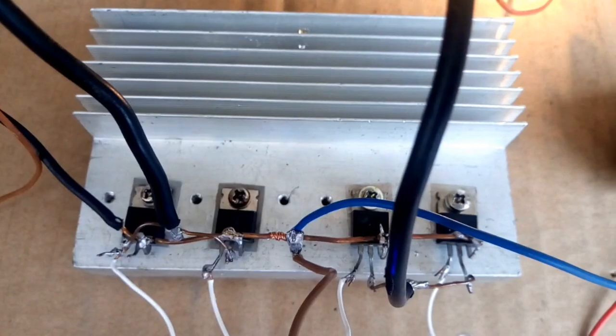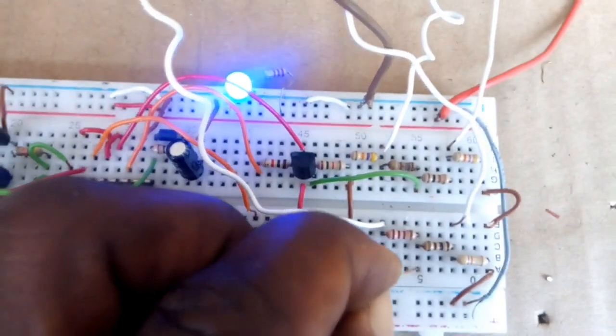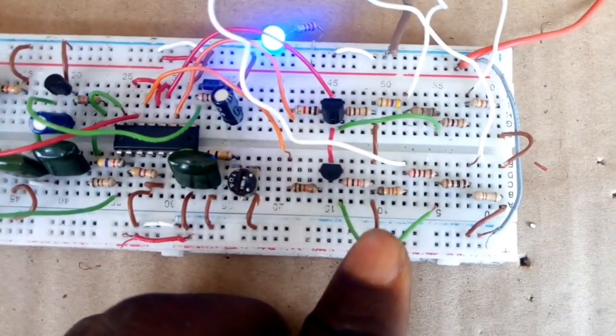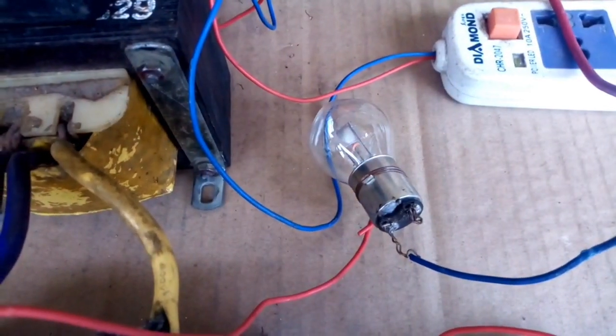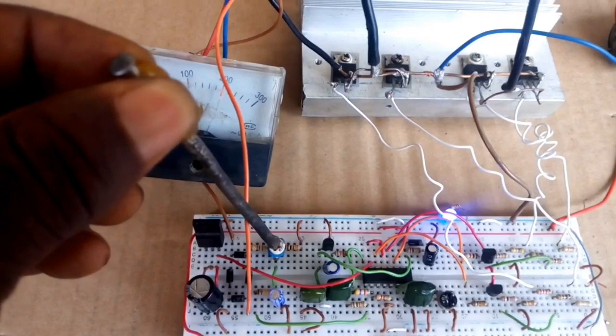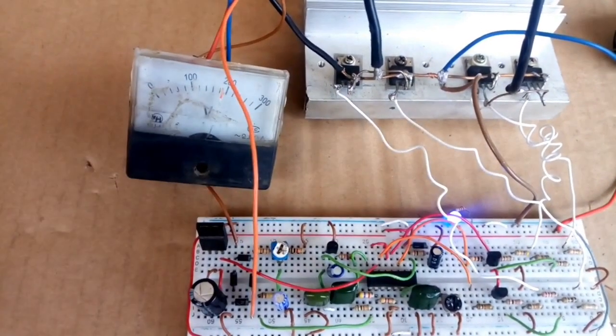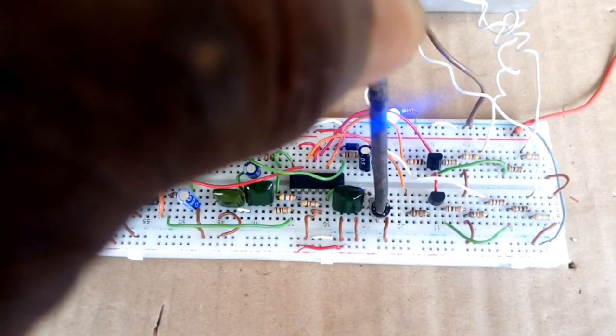Do not connect the wire from the central tap of the transformer to the battery clip — if you do that you will destroy your MOSFET. You will have to connect the second gate wire to complete the circuit. When you make sure there is no error in the connection, you can observe the behavior of the bulb and adjust the output voltage, setting the output frequency to 50 Hz.